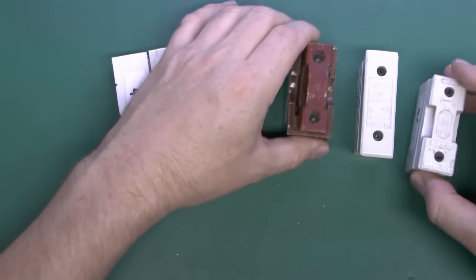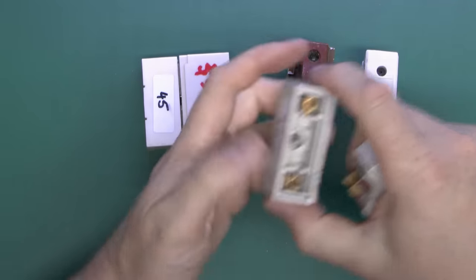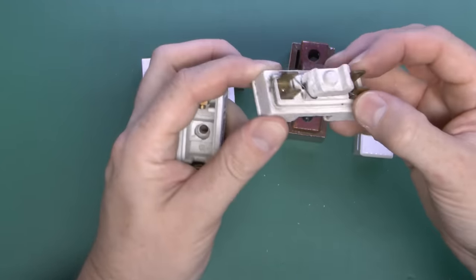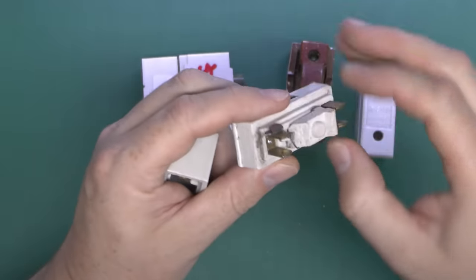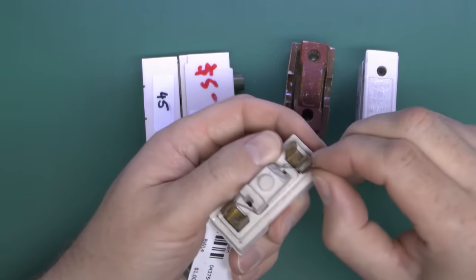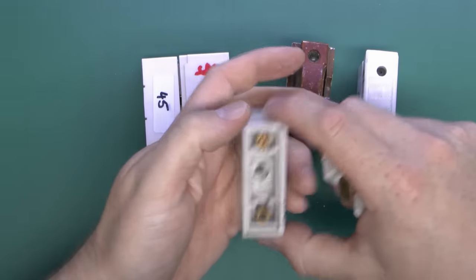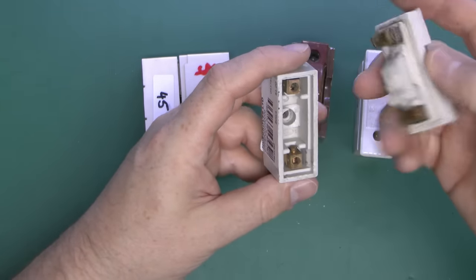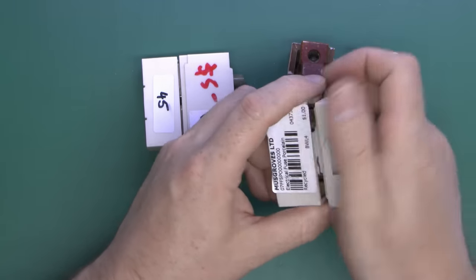And at this section we've got some fuses and a circuit breaker. Now we've got this ceramic example with a ceramic base as well. You've got your two terminals — one coming in and the other going to your circuit wiring — and the fuse just plugs in over the top with twin contacts going over the sides. Little spring pieces on the side secure the wire, basically a wrap-in design, so there's no actual screw to attach the fuse wire — it just slots underneath the little tab at the end, and the same at the other end. The piece is broken off that one. A single fixing in the centre, and of course the wiring comes in and goes out via the back. The problem with these is that if you don't turn off the power first, when you take the fuse away one of the terminals is going to be live at all times — certainly not something permitted today.